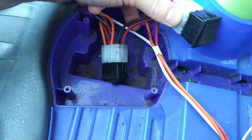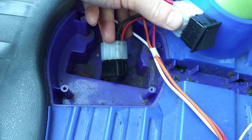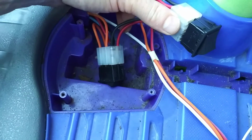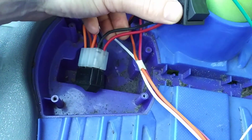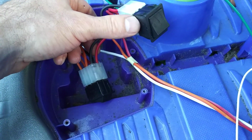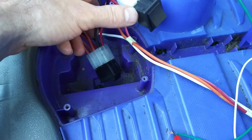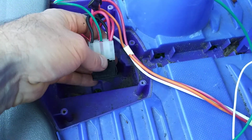But also, actually, you can't delete the switch, because if it's not there, you only have one wheel turn at a time. So you couldn't just output directly from here. And it's fine to have speed control. Why not, right? If it's doing the job of splitting the power to both motors, that's great. If you need to pull it down so you get less amps, great. Let's keep everything as stock as we can.